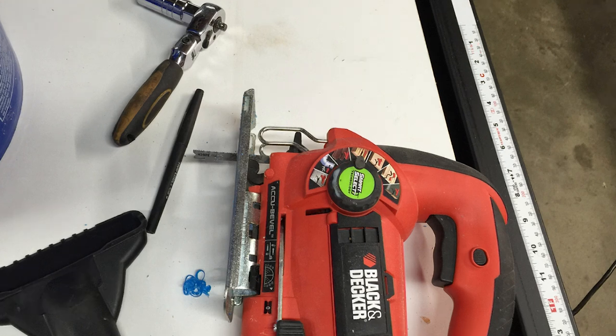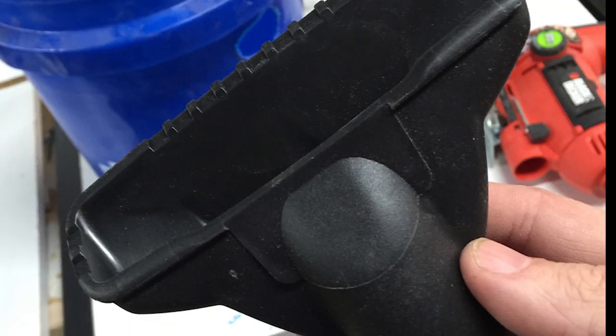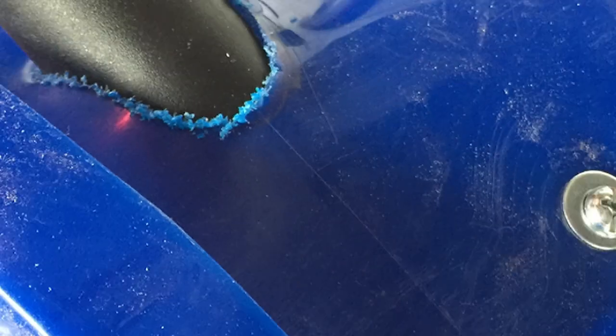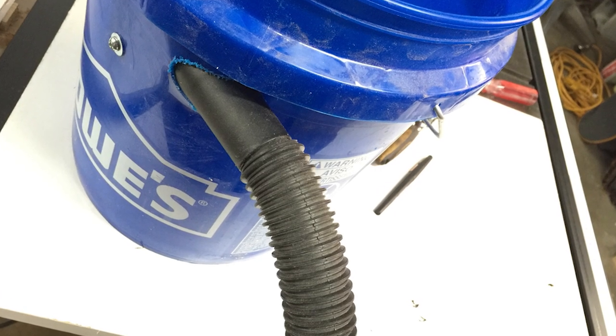To make the pre-filter, we have to modify the bucket itself a little bit. I cut this funny shaped hole in the side — it's sort of like half a circle and half an oval. In that funny shaped hole I inserted a piece of an old vacuum attachment. I got this idea from Ryan Nodwell on Shop Build — he's the one that did this originally, the person I completely copied this from. So you cut a hole in there, put your vacuum attachment in just like this, and I attached it with nuts and bolts because I knew it would take a lot of stress. Once it was all attached, I siliconed up all the cut spots and any open spots that might leak. Then I just attached all the hoses up and tested it — you put the shop vac hose in the top part of the bucket and on the side you put the hose that you're going to suction things up with.